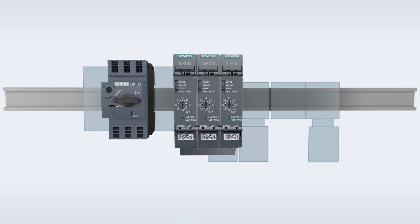The high-performing in-feed system allows savings in the wiring of the main circuit. It furthermore facilitates the installation of group structures, for instance in conveyor systems. A circuit breaker protects the group from fault currents up to 55 kA.